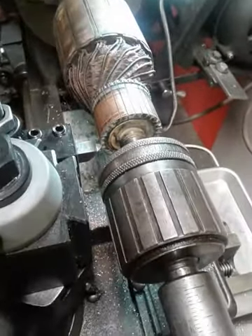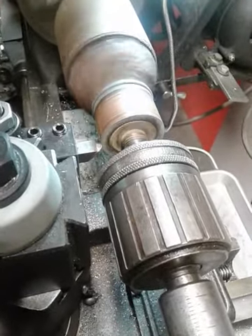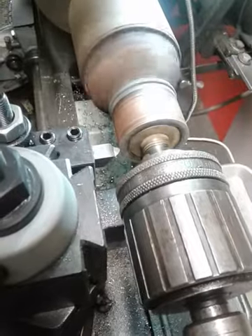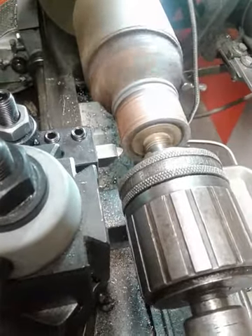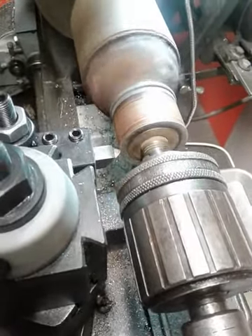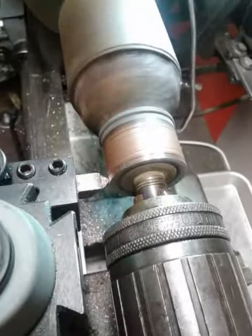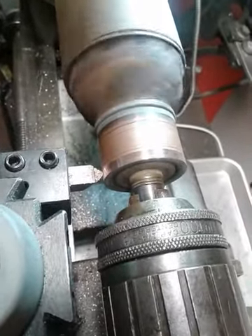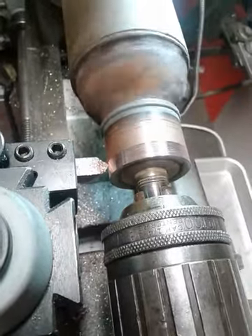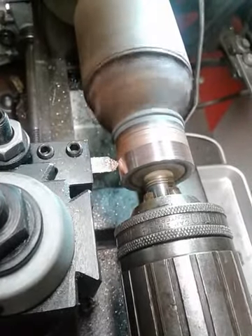I'm going to start it up and we're going to go. I may have to bring the bit in a little more. I'm going to bring it in a few thousandths. You can see that it's just cutting a very thin amount here, just a few thousandths of an inch I'm taking off. And that'll take the grooving out that's caused by the brushes rotating in it — occasionally you get dirt or grit in there that runs a groove. This just gets that commutator nice and clean and even again.